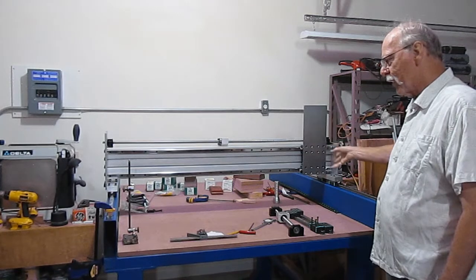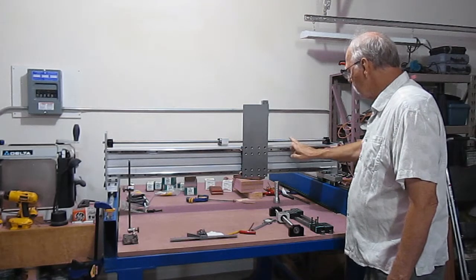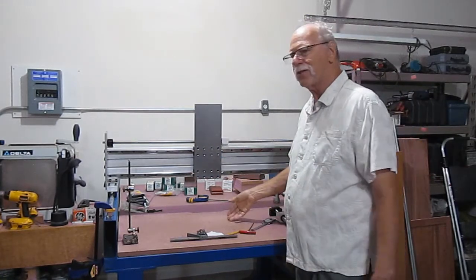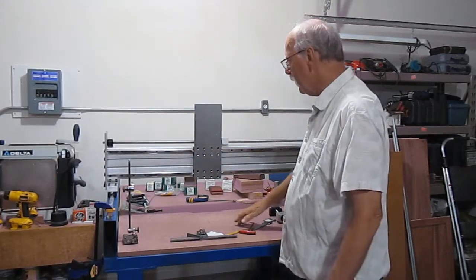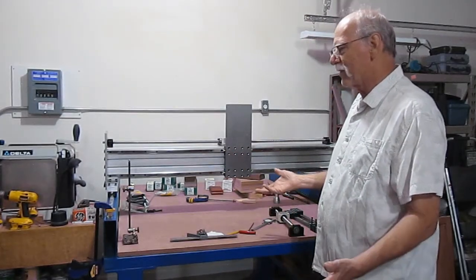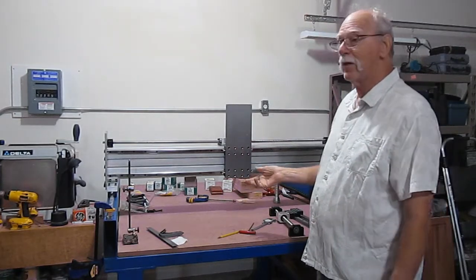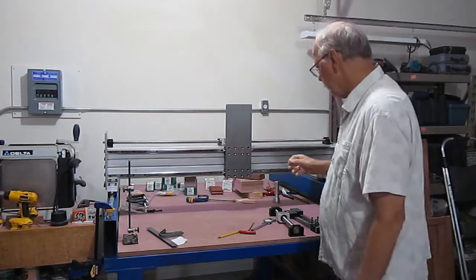Come over to the opposite end, do the same thing, and work back and forth, continually aligning this bearing rail to this one. And that's what these bearings will do for you. Pretty much self-aligning. So just work end to end, make sure you have everything all snugged up. So it's as simple as can be. Just a little bit of effort, slow down, don't go fast, and you'll get the machine very, very close with just simple hand tools.